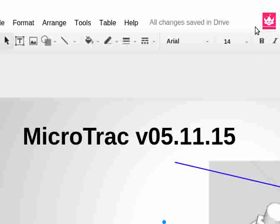I've got the trencher sitting out here not doing anything, because we have to have a heavier tractor to mount it on because of the weight. That 6-foot wide trencher wheel is disused until we have a heavier tractor, because the back of the tractor just kept coming off the ground even with 3 power cubes. So we have to rework that. But we have the 3-inch shaft universal wheel drive units ready. We have 2 of those.